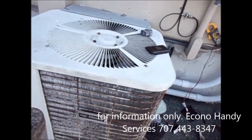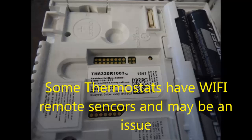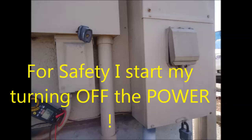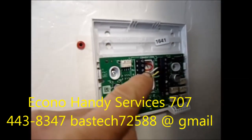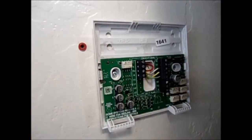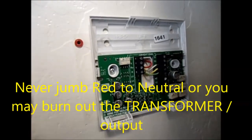I'm working on this AC unit here. If we take the red, which is the power line, to the red and yellow, the air conditioner should come on. The red and the green is the fan. So you take a jumper, jump across these and your air conditioner comes on to the yellow — and basically you need a new thermostat.